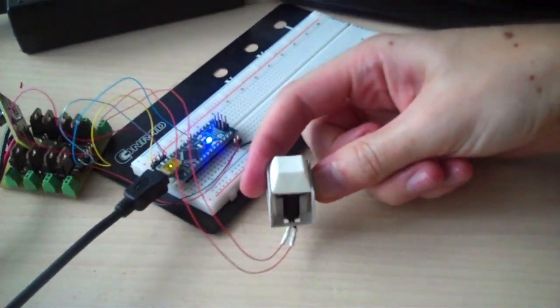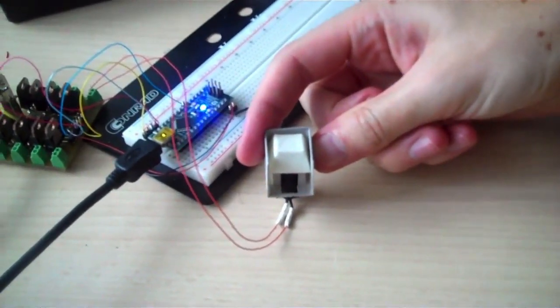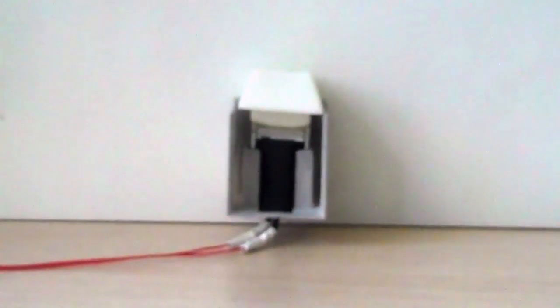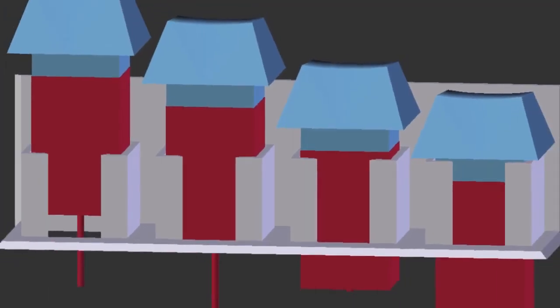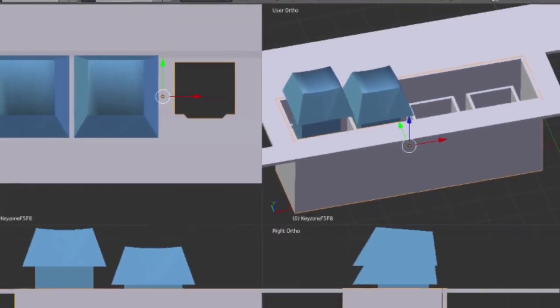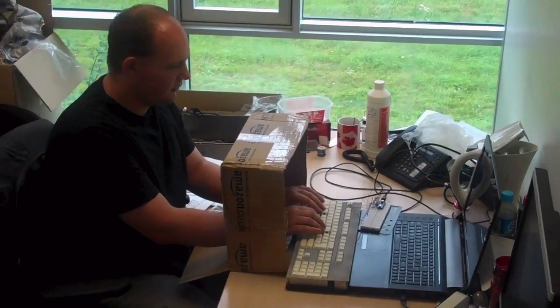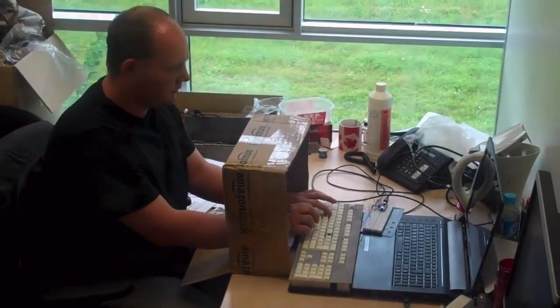The solenoids are small enough to be integrated into the keys. A pilot study determined that an elevation of around 4mm allows sufficient haptic perception without impacting the ability to easily reach the top of the key. We designed and 3D printed our own frame to embed our customized keys. We then ran a user study to investigate the ability of users to select hotkeys eyes-free, as well as the impact of raised keys on speed and accuracy.